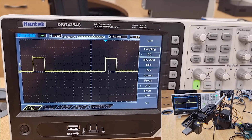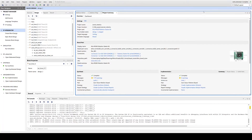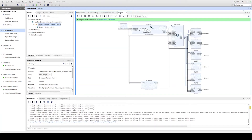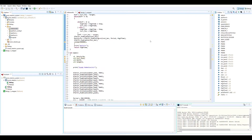We can see that changing here as we change from one width to the other. The project was all created using Vivado and Xilinx Vitis. We used an IP integrator approach, and one of the most important things in here is the Zynq processor system which contains all of the configuration for the ARM A53 cores, the R5 cores, and that's where our software runs. We connect, of course, to the six AXI timers that we have and the PWM outputs.